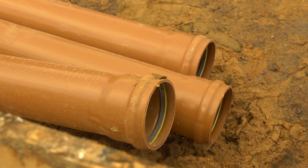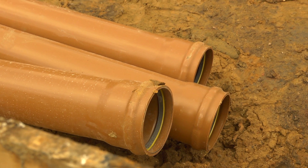The strip foundation is in, so what are the next steps? We'll be looking at doing the blockwork up to damp course, ready for the block and beam floor to go on, getting some of the drainage in that's got to go into the floor voids, and also getting service pipes in.